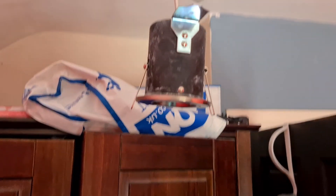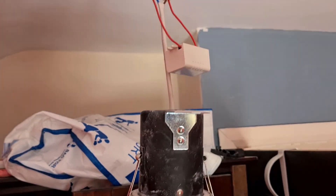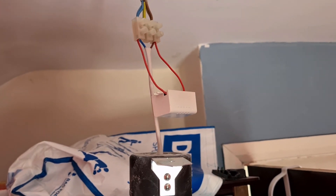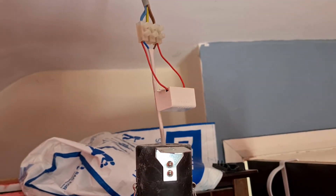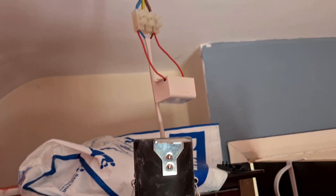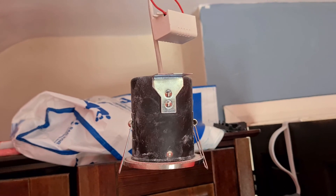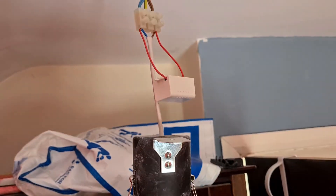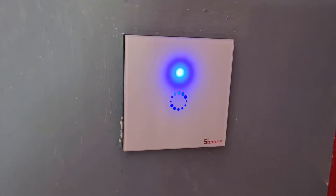I have these LED spotlights — four of them in this room. I've installed the capacitor just around the live and switched live going to the light, and that's it. Pushing it all back in, hopefully hidden in the ceiling.